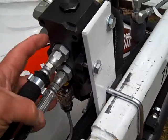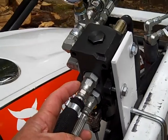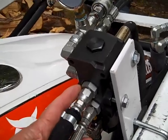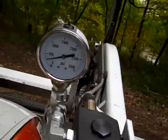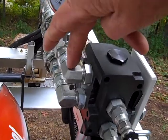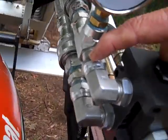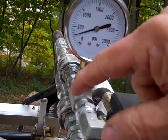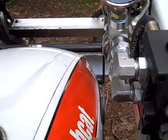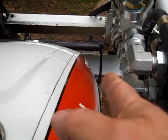It comes with SAE half-inch adapters to half-inch JIC. This tractor had 3/8 JIC so I had to get different adapters — they sell those on the website. These 90-degree fittings I got locally at a company called Pillar down the road. I had to grind this nut here because it was so tight I couldn't spin it, in order to have clearance for my hood. Generally you could just bring it out further and it wouldn't be an issue, but that's what I did and it's worked out fine.